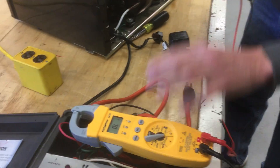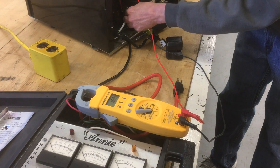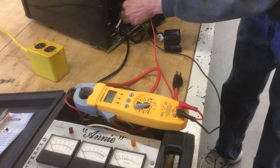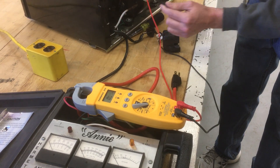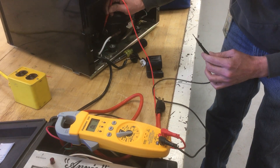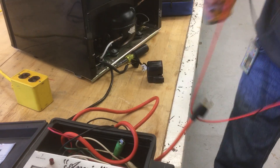I'll go ahead and set it to ohms. Going to the bottom two terminals I get a reading of 16.8 ohms - that's the resistance of the wire inside the compressor. Then the other two pairs: about 7.5 ohms and about 10 ohms. The biggest number between two leads - that's 16.8 - means common is directly opposite. The smaller number, 7.5, is going to be run, and the middle value of 10 is going to be start. So it is common-start-run, confirmed.